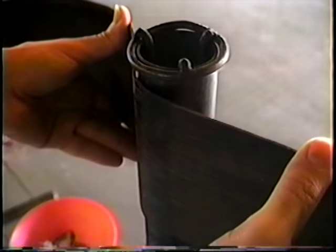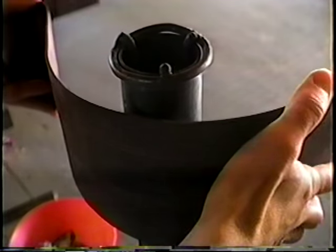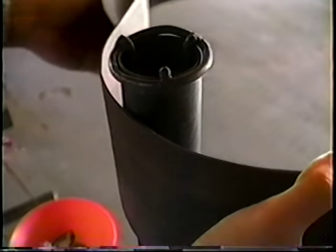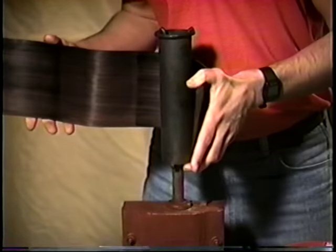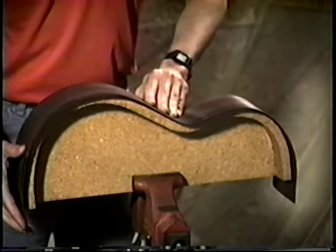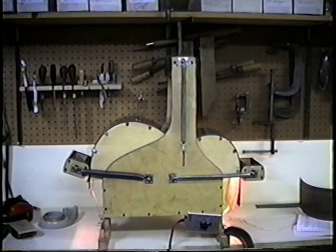To get a smooth bend, we first rocked the wood and heated up an area larger than the bend. Only by experiencing the feel of the wood bending can you tell how much force to use before it cracks. If you discover an over-bend, just reheat the wood and bend it in the opposite direction. Probably the easiest method for the home craftsman, especially with highly figured woods, is the side bending machine. Heat is provided by three 100-watt light bulbs, and the wood is sandwiched between stainless steel sheets to even out heat and prevent scorching and splitting.